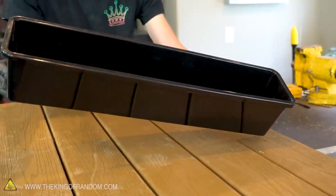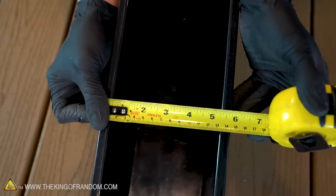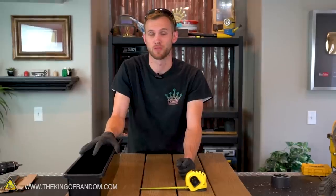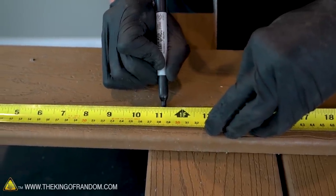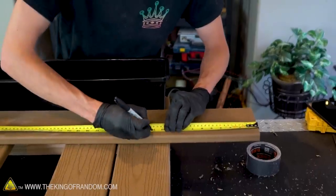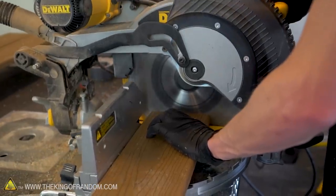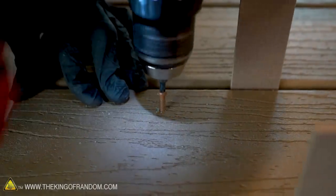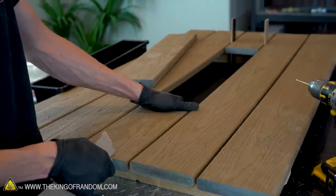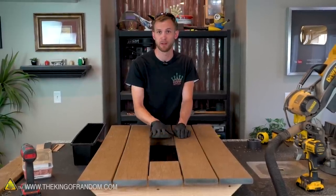What we're using for our cooler is a plastic planter's trough from Home Depot for about eight bucks. This planter box is 25 and three-quarters of an inch long and approximately five and three-quarters of an inch wide. This size works very well because its width is almost identical to the space between two of these boards if one is removed. We now want to cut a length out of the center of the board that matches the length of our planter — some quick math shows we should come in 11 and one-eighth of an inch from either side. With our center board cut, we can replace the spacers and use a couple of screws to hold the end pieces in place. These end pieces are sturdy as-is but will get additional reinforcement from below.